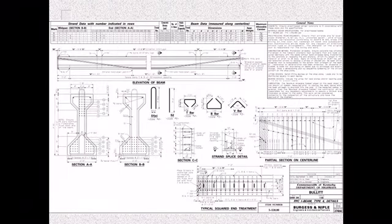Here is the plan for what a PPC I-beam type 4 should be like. The contractor is going to send this out to their pre-stress manufacturer to get shop drawings back. The shop drawings are going to have to meet this sheet. This is good detail. Make sure you read the general notes. This is usually going to be between 15 and 20 in your bridge plans, somewhere in that sheet number. But check it. Your biggest thing you want to look for is the shop drawings, because they're going to detail everything you need to know about the beam and placement.